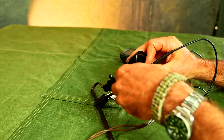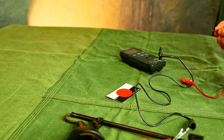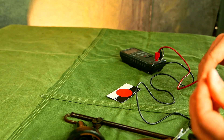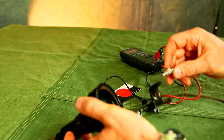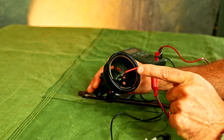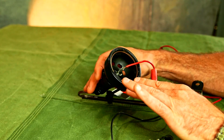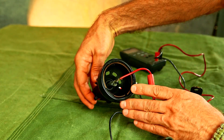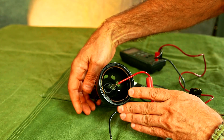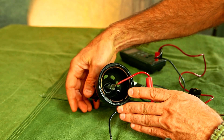I'm going to try these alligator clips in there — maybe that'll help me get on it. I've found that one of the electrodes is always on with the switch in both positions, but the other electrode is the one that's switched. Now I can flip the switch and you can tell that the switch completes the continuity, so I know this switch is good and this light is going to work.